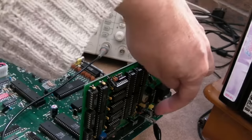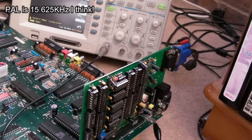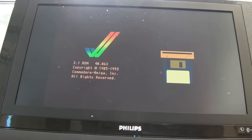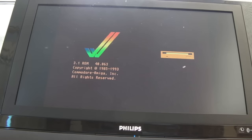The 564 is a PLL — it replicates the functionality of Amber in the A3000. It takes you from 15.1kHz up to 31-something kHz — I'll stick it in the top left, I can never remember the exact frequencies. It doubles the number of lines on screen, de-interlaces it, removes the interlaced lines. For the most part it's now displaying. I don't know why — I calibrated that little part so many times over the few days.